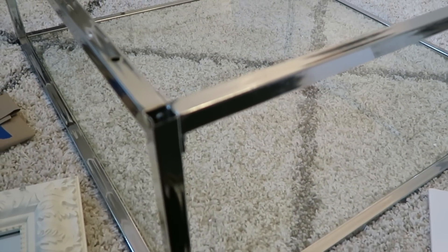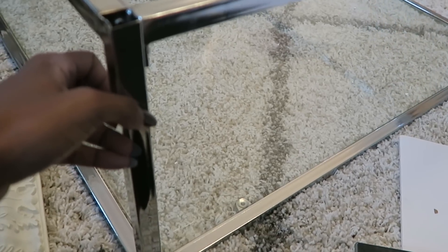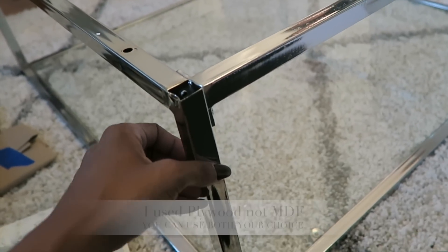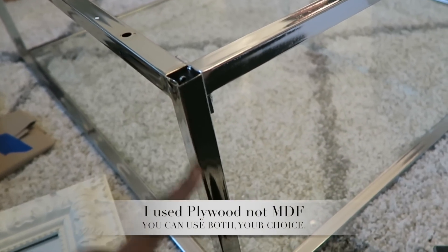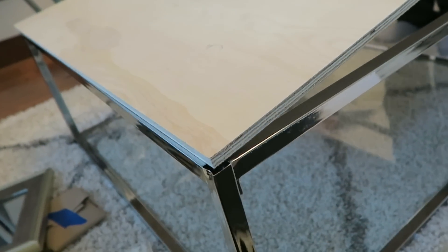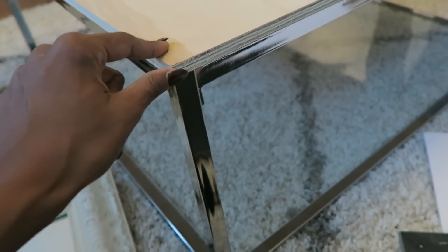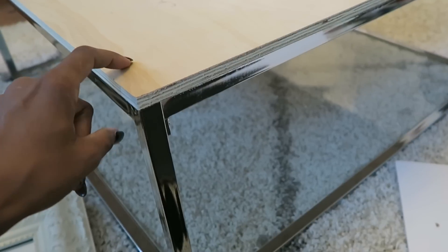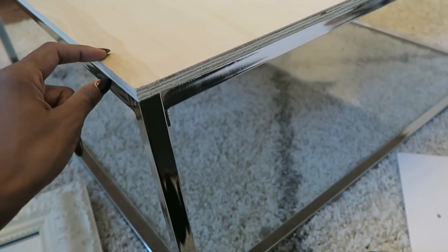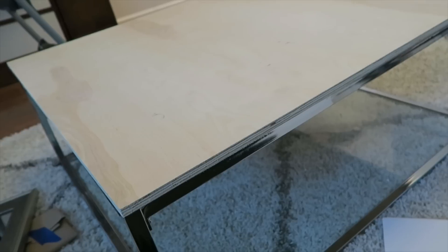Mine is a contemporary style base. I took the top off the table because I wanted to use it for something else. So what I did is I went to my local hardware store — you can go to Home Depot or Lowe's — and have them cut you a piece of MDF to size to fit on top of the table. If you have a glass table, you definitely want to take the glass off and go have a piece of wood cut. If you want it to be larger than the base, that's totally fine, but just make sure the base can handle whatever size you put on it. Then screw it down — most glass tables have holes in them already for the plugs for the glass protection. Use those to push a screw through and screw the two together, so you definitely want the MDF to be screwed down to your base.